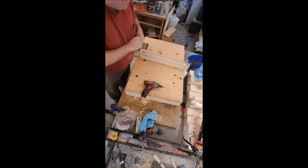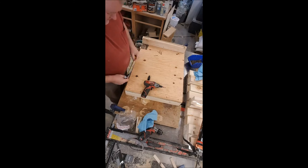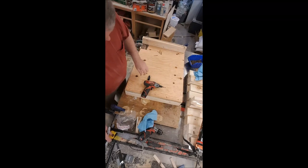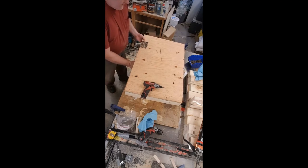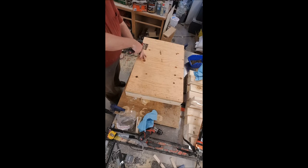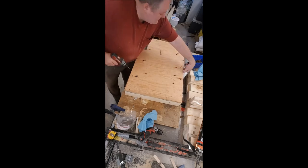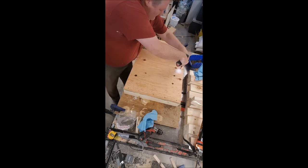Now for the center one. It doesn't have to be bang on dead center — don't get too concerned about that. Half of my pallet distance is 60 and three-quarters, so I make a nice mark right there. I slide this in, try to get glue everywhere. I center it on that mark on this end. On the other end where I can't see the 2x4, I have a trick — I put my fingers around it and get that black mark right in between my fingers.